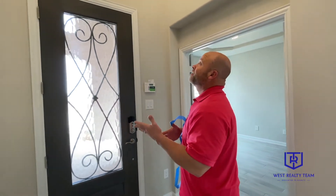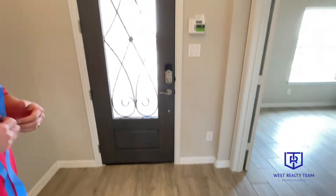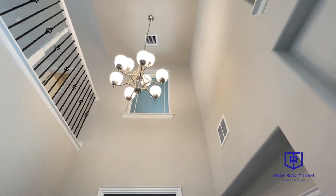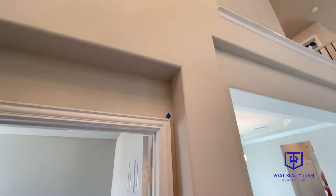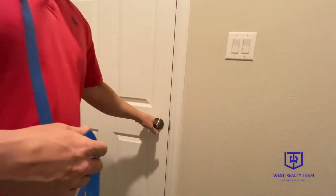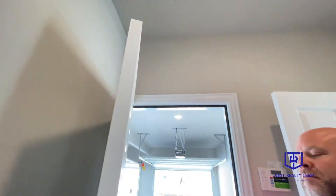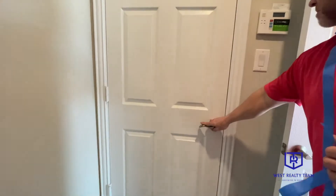What I'm looking for here — the big things are just floor to ceiling. Go slowly and look for anything: paint, fixtures, light switches, anything that's not right. I just want to put tape on it to make sure it gets corrected. Just want to look at both sides of the door, make sure they shut the correct way and fit right. And then a lot of it really is paint — you're just looking for touch-up paint and things like that.